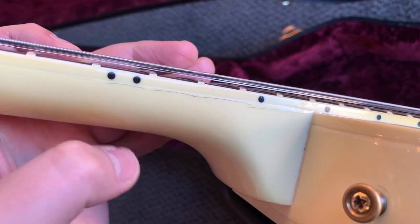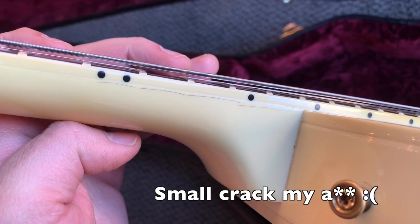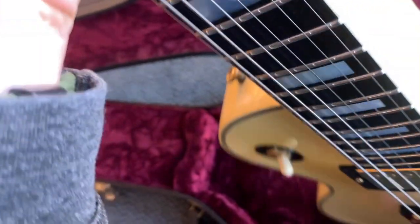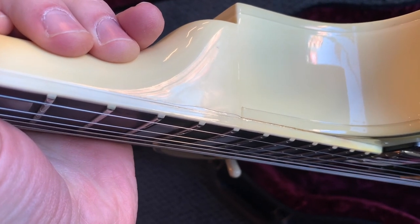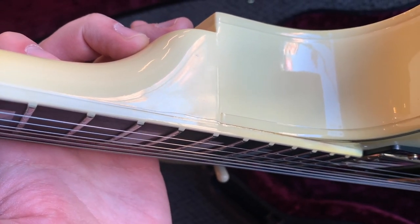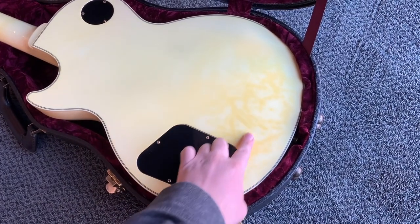Apart from the above mentioned, small cracks can appear in the Nitro finish after several years too. This occurs when a guitar is regularly exposed to different temperatures, as changes in climate cause wood to expand and contract. Nitrocellulose lacquer is thin and slightly porous, meaning that the wood it's applied to is more prone to this issue, as you've seen here in this example.